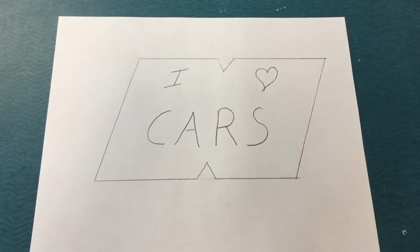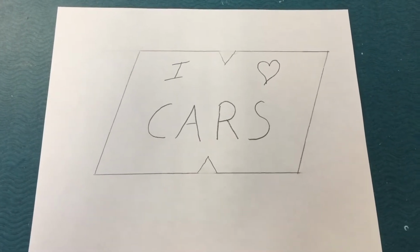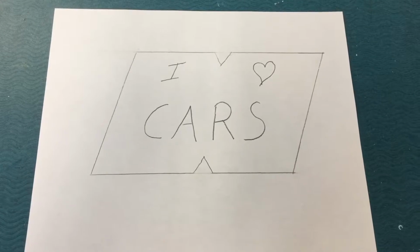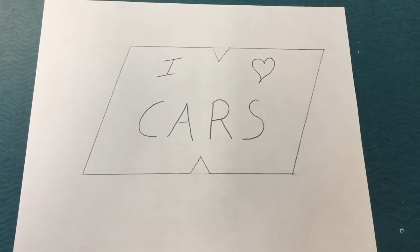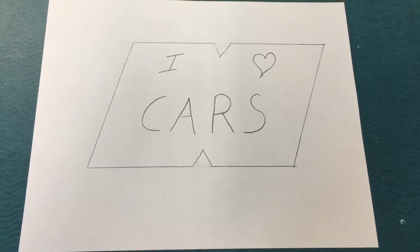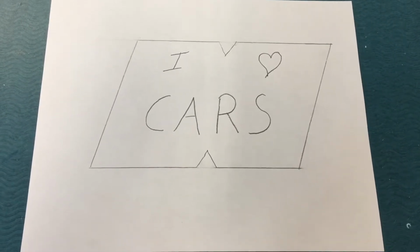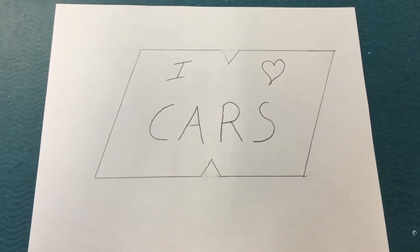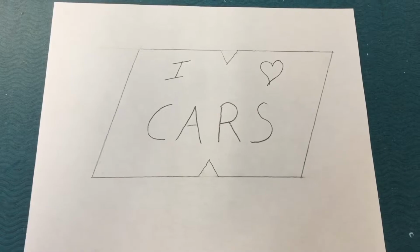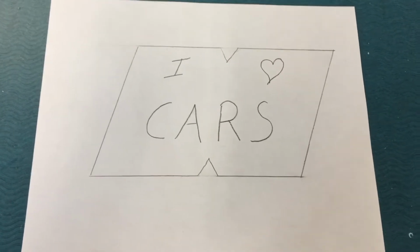First, think of a few ideas for your sign. Draw them out on a piece of paper, including the shape that you want to make with the outside backing board of your sign, as well as the message you want to convey. Ensure that any message that you're going to router out of the interior of the sign is made in large block letters, as the router bit that we use has a fairly large diameter, and so you cannot be too precise with it.